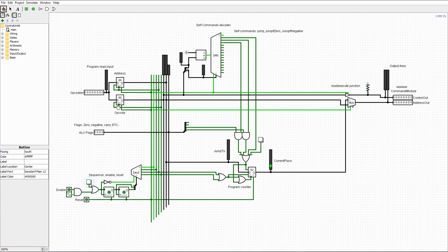The opcode is the operation you're trying to perform in program memory, which in this case is also part of general memory. The opcode has two parts: the first four bits — the least significant bits — select the module the control unit wants to talk to in the processor, for instance the ALU, memory, a stack, the I/O bus, or even a second processor.